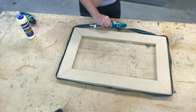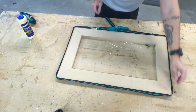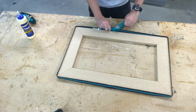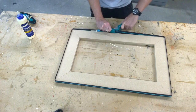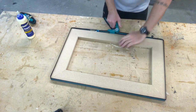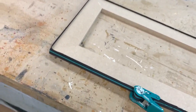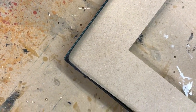Get the strap round, make sure it goes to the bottom of all the corners, and then just tighten it up. There we have perfectly clamped mitres, and when I put the tape measure on this frame it was perfectly square as well, because I cut it accurately and clamped it up well.